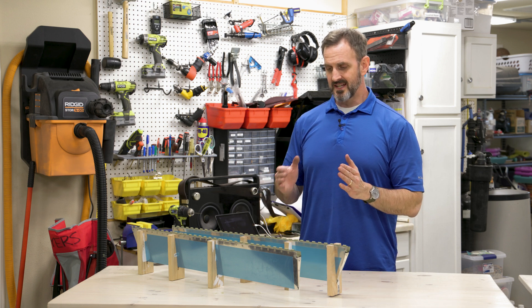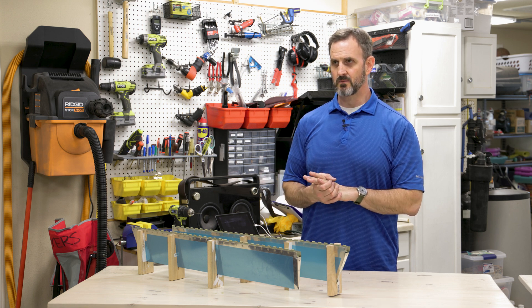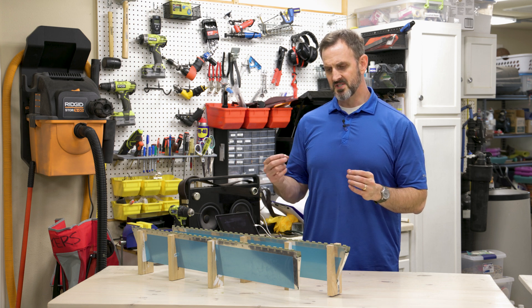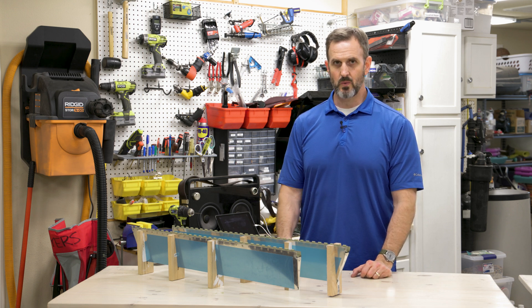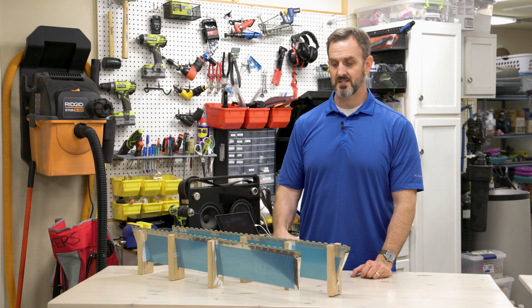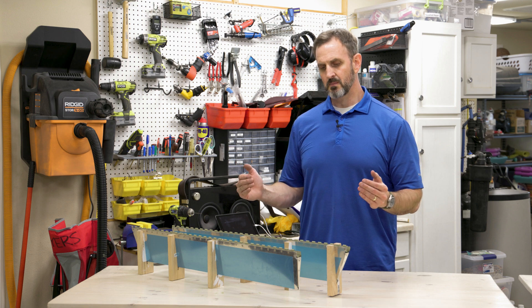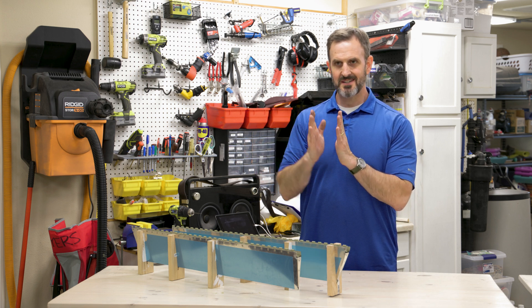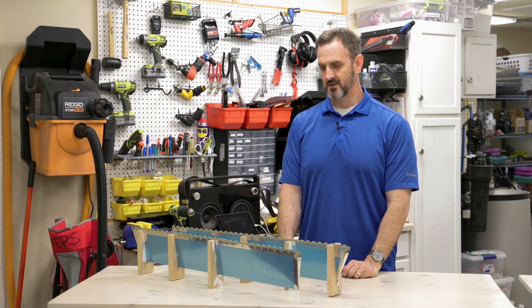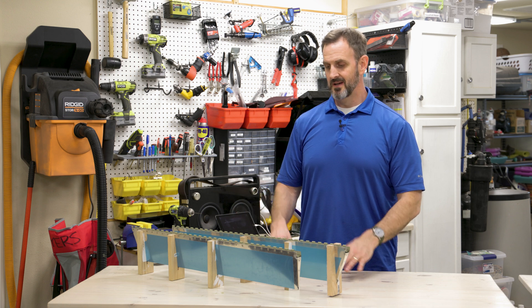I've been trying to follow the instructions better because I do want the plane to ultimately fly, but I wanted to get it done. When I was riveting the bottom spar there were a couple rivets I had to drill out. I'm not always getting good results with back riveting - even though I turned the pressure way down, when I did the elevators I got fantastic results, but this time I had a couple rivets that kind of wanted to bend over a little bit. So when I back riveted the bottom rib on the second trim tab, I was more careful - I'd just hit it a few times, look at it, and adjust if needed. Those ones came out all right. What you're gonna see now is a time-lapse of me putting these together.